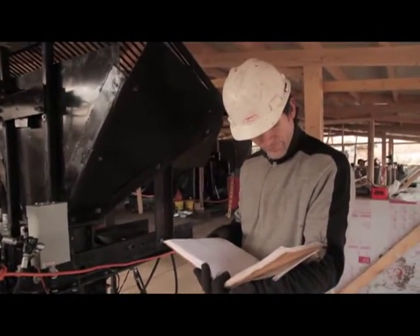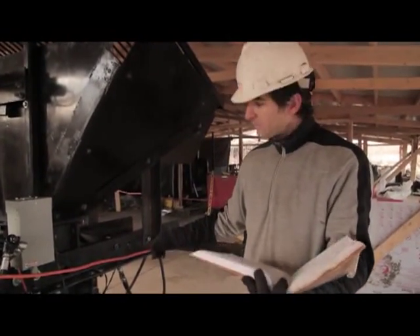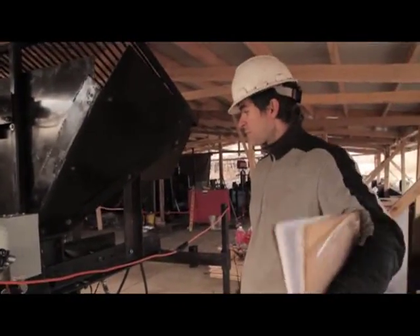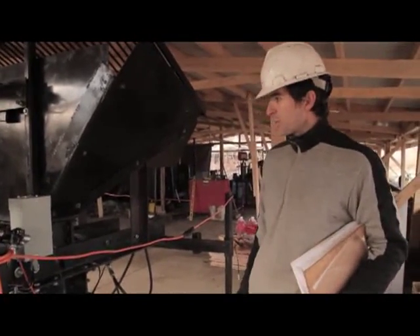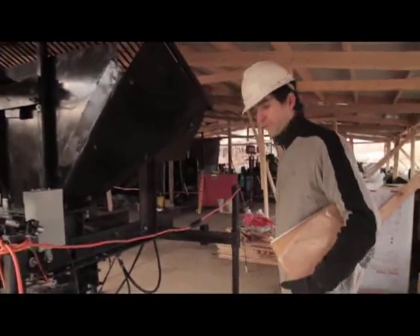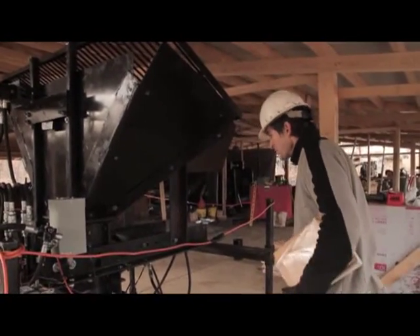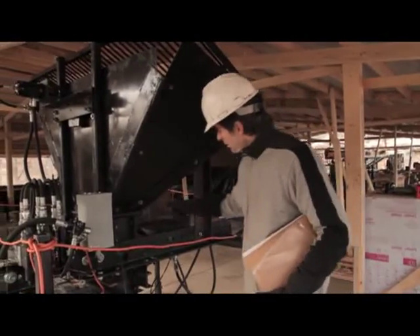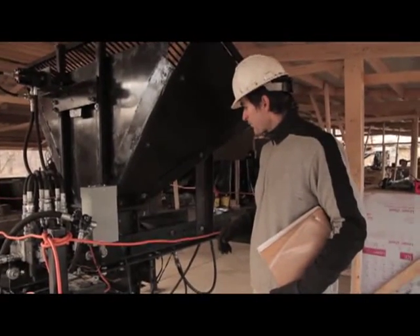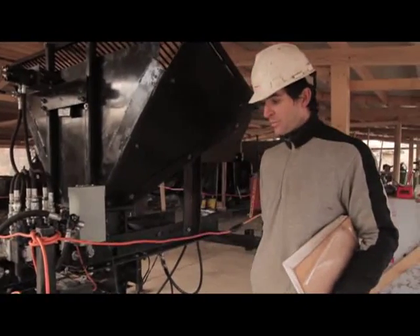Make sure that the safety rope is on. Before you start, it's a good idea as general safety to do a visual inspection of everything — are all the hoses intact, have they worn out, are there any loose connections or hydraulic fluid leaking anywhere? Are bolts loose? You might want to visually inspect to see if all the bolts are tight. The machine does vibrate and it's all designed for disassembly primarily, so you do have to pay attention that all the bolts are tight.